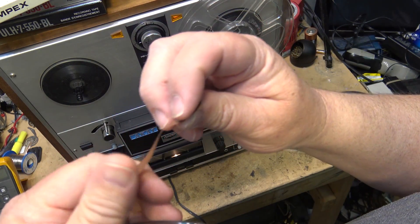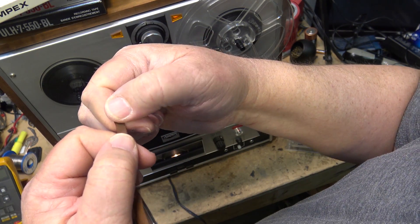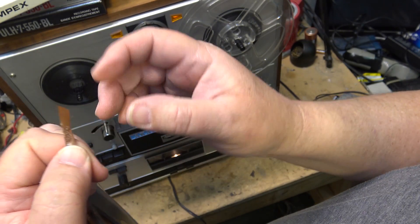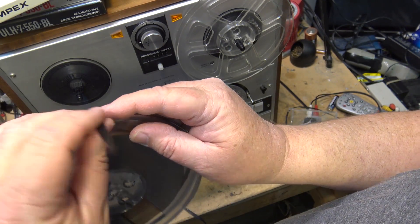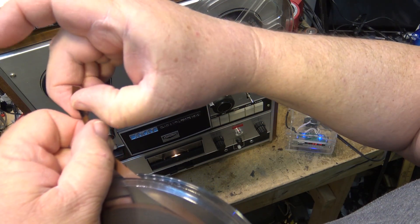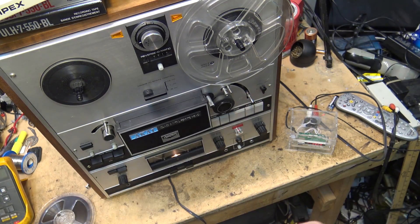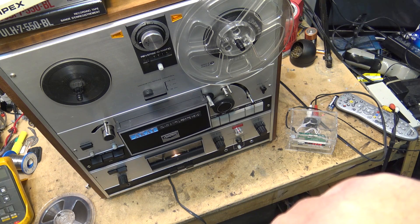How you can tell the back side of the tape from the front side: some tapes are pretty shiny on both sides. Just give the end a bit of a tug — if you stretch the tape, the oxide will actually come off on the side that is the recording side. That's the quick easy way to tell which side of the tape is the oxide side, especially with higher-end tapes from the 1970s that looked shiny on both sides.